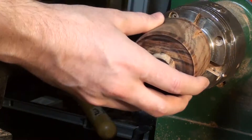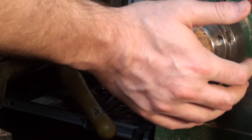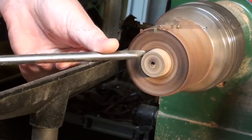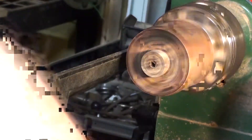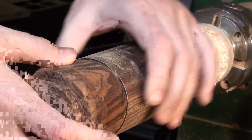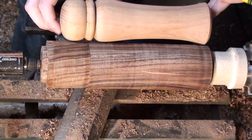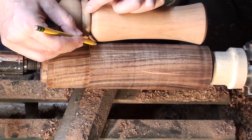Next, I mount the head of the pepper mill and drill a 9/32 inch hole through the entire piece — this part I forgot to record. Here I'm trying to fit the hole in the body to the tenon on the head of the pepper mill. Luckily, with the power of editing, I got this right the first time. I mount the body and head piece and now I'll be turning it to shape. I apologize again for the camera quality.